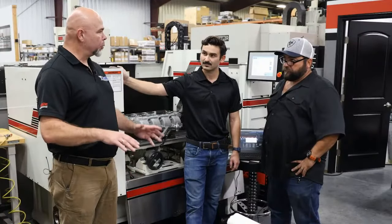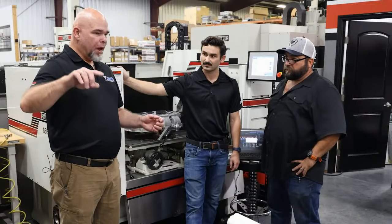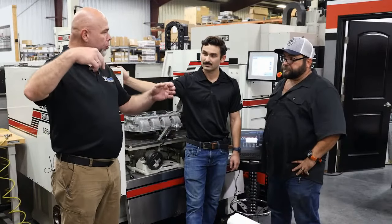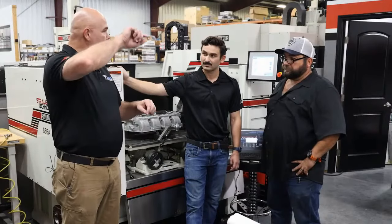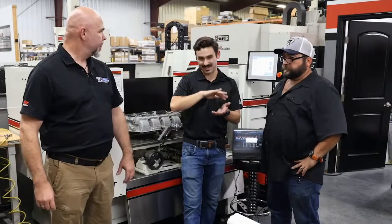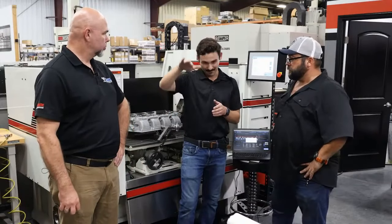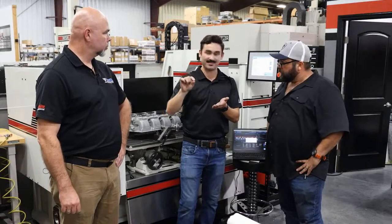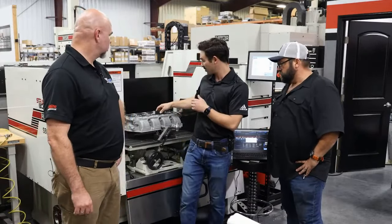Waviness is a parameter that's harder to measure. Roughness is basically your traverse speeds across and the type of tool you're using — that's what gives you surface roughness, peak to peak, small undulations. You can think of waves on water or think about the road we all drove in on — big large undulations, mountains and hills — and then also some texture within all those features. Skidded-style profilometers can't get waviness measurements; you need a different tool to look at those bigger features.